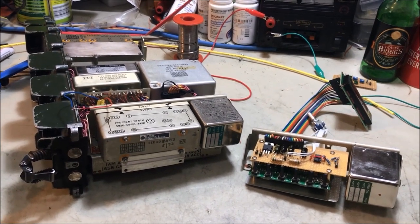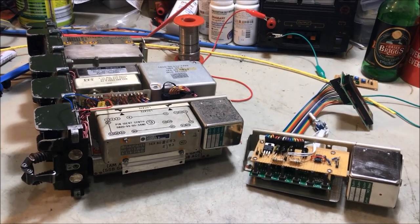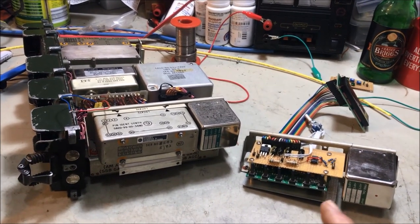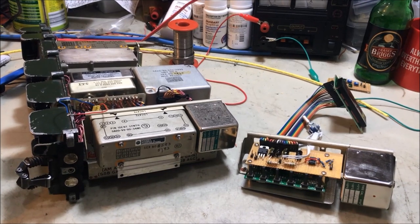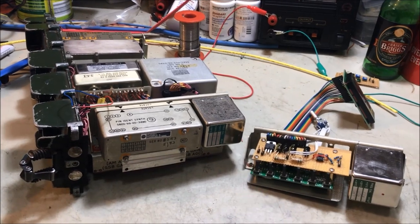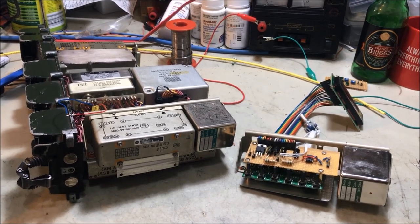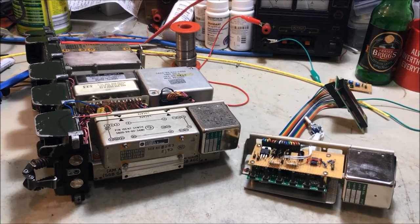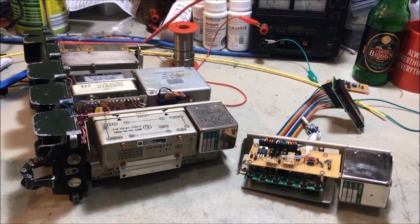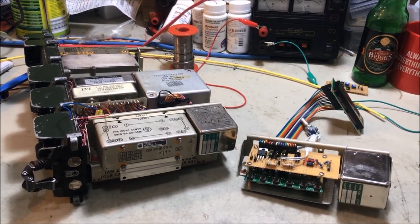So basically, looking at the upper and lower sideband installation conversion, whatever you want to call it, there's basically three options the way that I see it. The first option is to incorporate a DDS that's got two outputs, as I suggested, a variable and a fixed. The fixed to look after the upper and lower sideband to replace that unit. The second option is to get hold of one of the chips that they use in the standard Clansman 320 lower sideband conversion. I think the kits are available from Clansman Radio in the UK. He sells the whole thing as a kit.